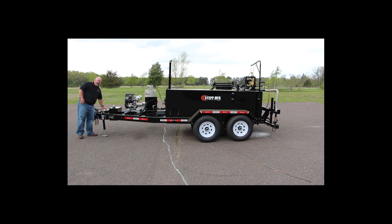Right behind the hitch we have our battery box. It's a group 24 deep cycle battery, nothing too special there. Hydraulic oil — this unit is driven by a Kohler LPG engine, so the Kohler's got an LP carburetor on it. It does drive a hydraulic pump, so you've got some hydraulic oil in here. The hydraulic oil is just an all-weather AW32.